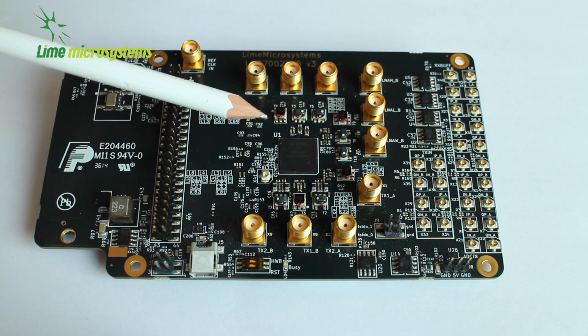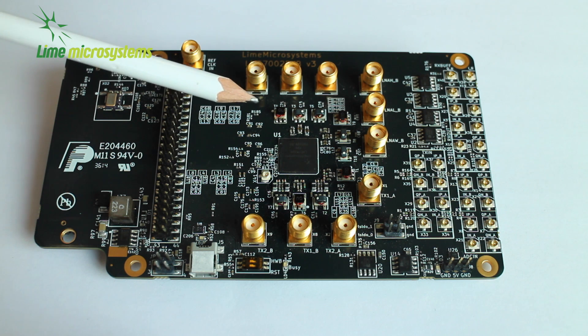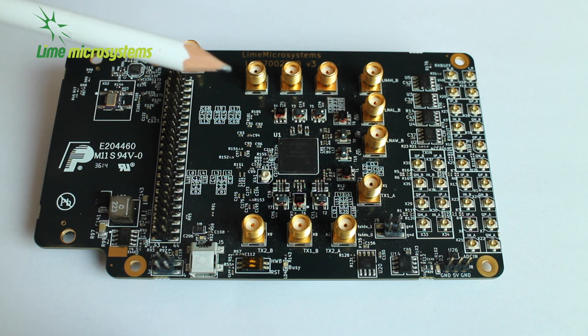The chip itself contains a range of features. It includes mixers, variable gain amplifiers, voltage regulators, and programmable analog low-pass filters, which are tunable from 600kHz. It includes Nyquist ADCs and DACs. The ADCs can run up to 160M samples per second, and the DACs up to 640M samples per second. It also includes analog power detectors and received signal strength indicators. There is an on-chip MCU, or microcontroller, and various loopback networks for automatic calibration.